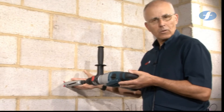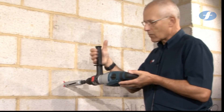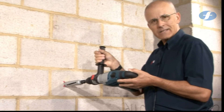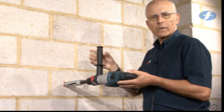Drilling a small diameter hole through this wall with a view to installing, for example, a gas pipe. We'll be using this particular position for the front handle, and you can see that the handle will kick into the hand so I'll be able to catch the kickback. If a jam should occur, the safety clutch will activate.